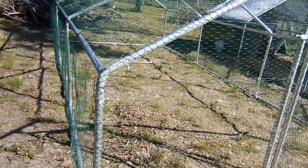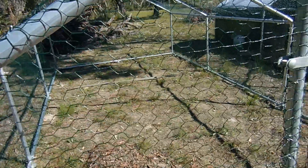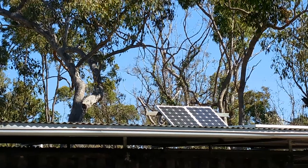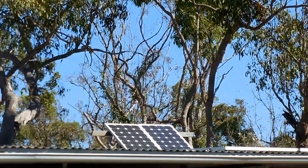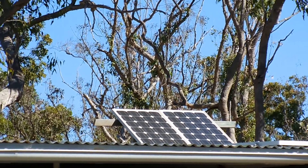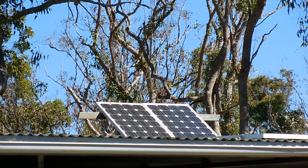That's what will eventually happen to this pen once I finish constructing it — I've got most of it done. It's all plastic-coated mesh, which will help stop corrosion. I've got the cable tied at the bottom and I've started the front. In our last video we were talking about troubles with our 12-volt system that controls the water pump for the house as well as our hot water system. You can see up there those two solar panels — I've raised the angle of them. They're two 80-watt panels connected in parallel at 12 volts, going down to the 12-volt charge controller in the pump shed, and that has helped in winter due to the lower angle of the sun to keep the battery charged.